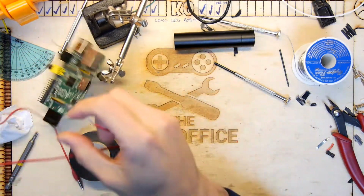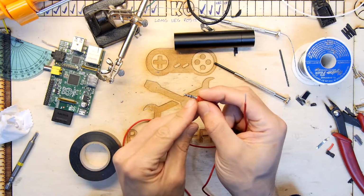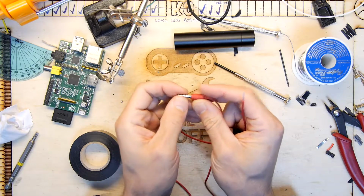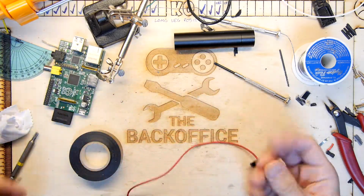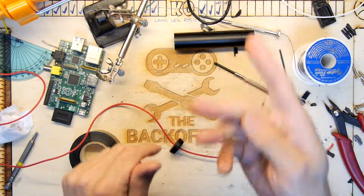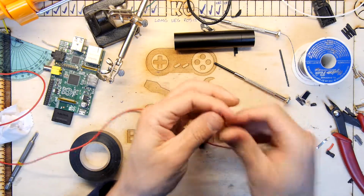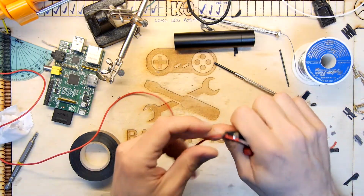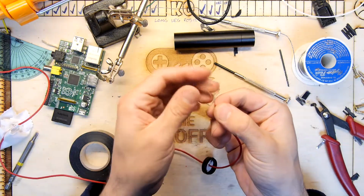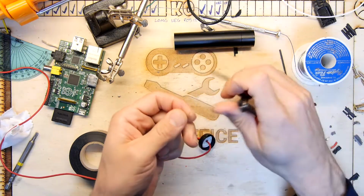So with the pinouts of this, the ground will be here, and then I think you normally get left and right or right and left. We don't really care, but we do know there's a bias here, so the ground is going to be negative and the other ones are going to be positive. If you noticed, our microphones had red and black wires, but we'll be having a look at those closer soon. But let's just buzz these out. We need to know what the polarities of these are. There's 3 wires. How nice. And it's that horrible cloth stuff.